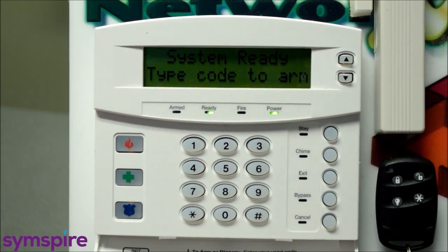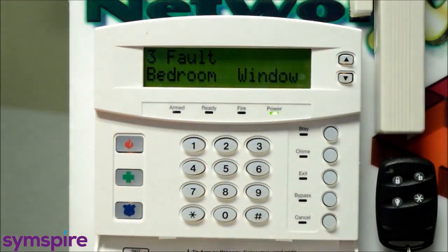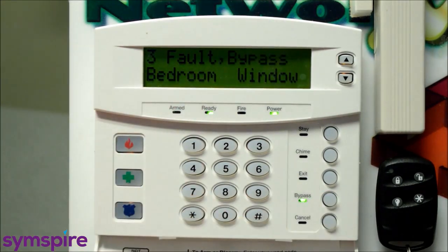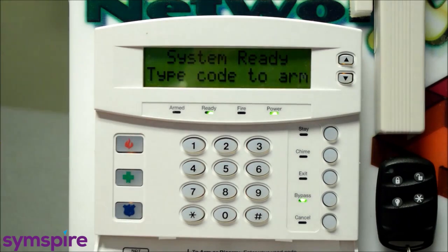So for residential, what I'd recommend is open the zone or zones first before you arm the system. And I'll simulate that by opening a zone here. It'll go from ready to arm to secure not ready. For help, press the arrow keys. I'm just going to show you that it's saying zone 3 fault bedroom window. All you do, once you've found the zone in the description on the screen, is press the bypass button. It will come up and say bypass next to the zone. Press the pound key. And you'll notice now it says type code to arm, even though that zone is open.